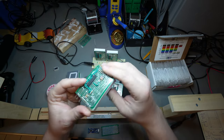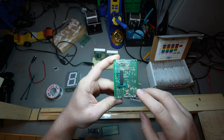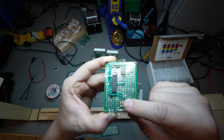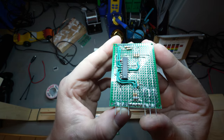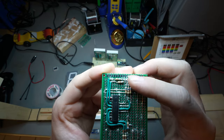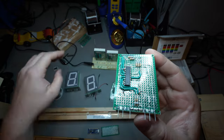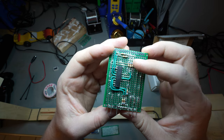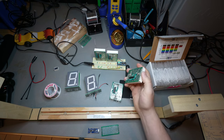And then the back-facing ones are the ones that I did second, where again, these on the bottom are flipped. And so the hard lines had to kind of come around. And then as I went through it, I got better and better at wiring up the LEDs on the shift registers. And something with these is that I think I ran out of the other solder and I started having to use this solder that I got. And it started leaving behind a bunch of residue after the wash. So I think it's just the flux that's in that that didn't do too well.